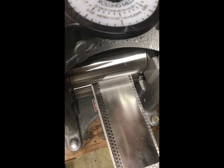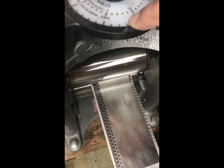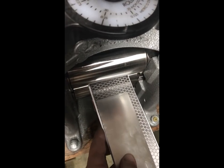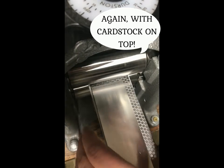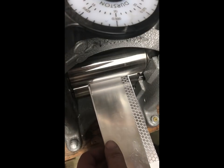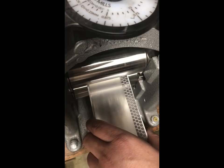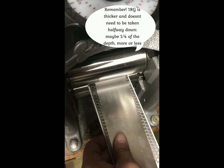That's a little bit too close. Now I'm really going to torque on it — wrench it down — and it's sitting at about an 8 right now. See my little tick mark there? I'm going to un-grip it, pull it out, and take just the plate in until it touches. I'm not gripping it, not torquing it down — you do not want to ruin your rolls. Just until it touches, and that's at about a 21.